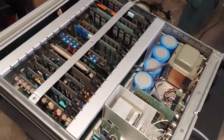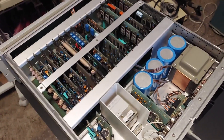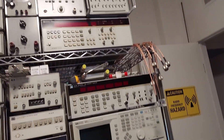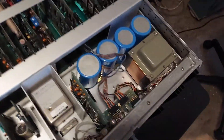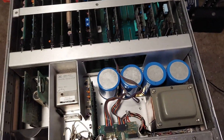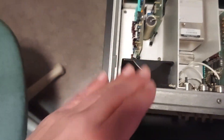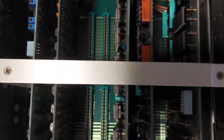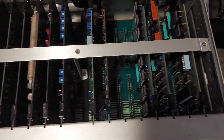Here's what she looks like on the inside. This instrument's construction is almost identical to the HP 5370B right there. It uses the whole back end — it's identical: same power supply, same reference oscillator and support cards, and apparently also uses the same backplane board. The difference of course is that it's populated with a different set of cards.